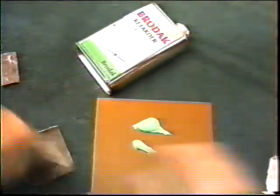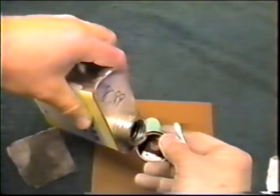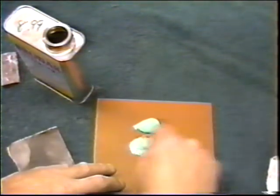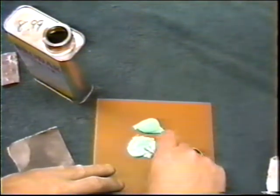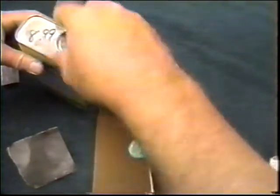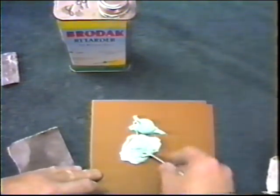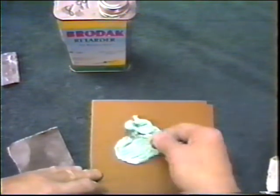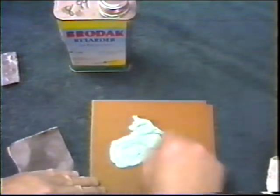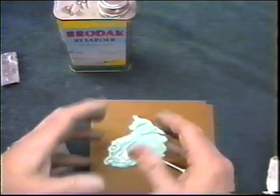The thing you don't want to do with this is try to build a fillet or build anything that has structure. A little bit of thinner, a little bit of retarder, even a little bit of acetone — just a few drops — makes it a little more liquidy. I just like it to be a little thinner because I'm only looking to do tiny little spots. Keep in mind, this is made to do body work on cars, so you don't want to put this on thick either. You want two or three thin coats — always better than one thick coat. You can even drag some of that in there, just like mixing concrete. The consistency you want is peanut butter. As in all composite work, mayonnaise and peanut butter are two of the consistencies you want to strive for. Right now that's going to be just about right — it'll have a dry time of about a half an hour.